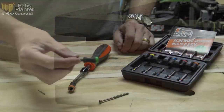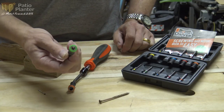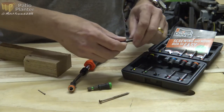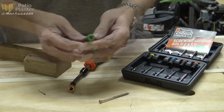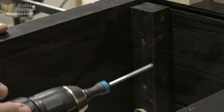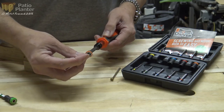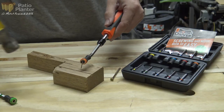During the video you may have seen me using this when I've been driving some screws. It's a magnet driver, it's by Micaton. Basically you have your screwdriver bit, hex bit, and a little sleeve that goes on top of it. The screw fits on and the magnet holds it — you can go upside down, anywhere you want. The other thing in here which I really like is a little fork which will take nails and little pins, so you can get your pin up close to the work without getting your fingers anywhere near the hammer.